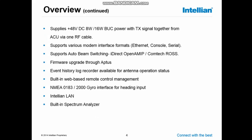The system supplies 48V DC on the TX-COAX cable from the ACU. This power is then used to power the BUC. The RX cable, which is connected between the ACU and the above-deck system, will carry 24V DC to power the rest of the electronics in the system.